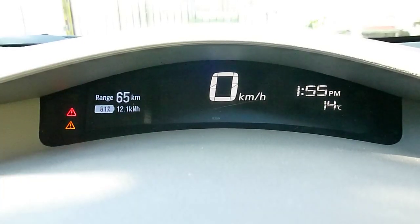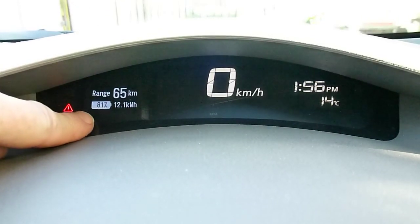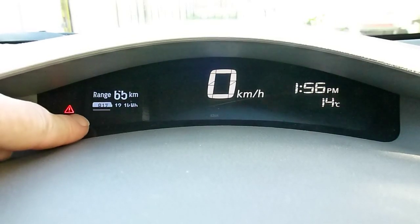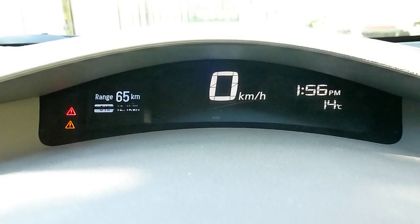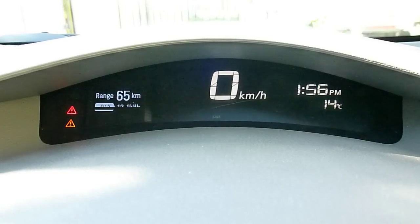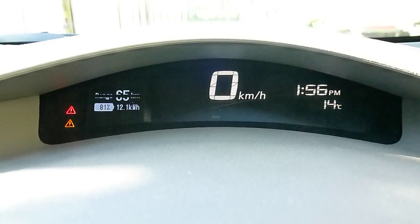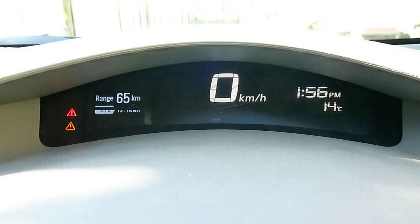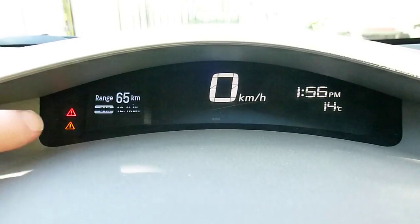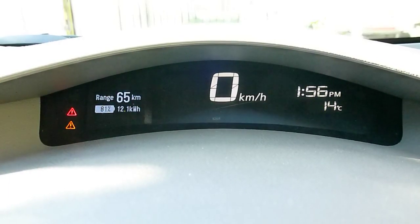And that is a much more sensible way of doing things. The other thing that I have automated is the upper limit for the state of charge. You probably know that in winter the capacity of an electric car battery is slightly lower than in summer. Here in Wellington, New Zealand, in winter the average temperature is about 11 degrees C, whereas in summer it's 21 degrees C. And that 10 degrees difference means that in winter it can't hold as much and in summer it can hold more. And then you've also got the slow degradation over time.